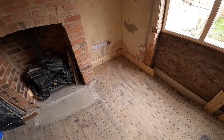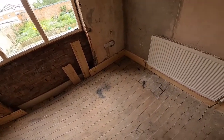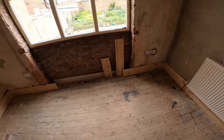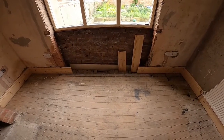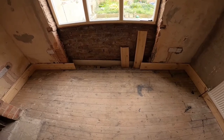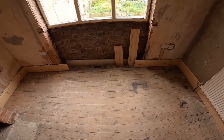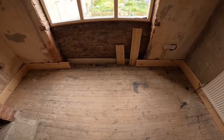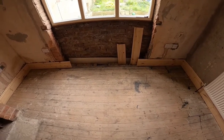This is where I'm going to leave this video - you can see all the skirting boards are on just about. The reason I've left those two bits a little bit longer is because a door frame is going in there for the French door, so once the door frame's in I'll cut them to the right length and do an external angle on them. If I do end up putting external angles on I'll make sure I do a little mini video about cutting an external angle - basically two 45s if it's a 90-degree angle, which hopefully it will be. We'll talk about that fully when it comes to it.